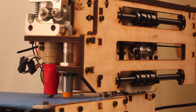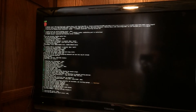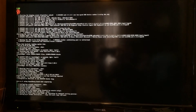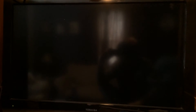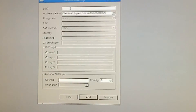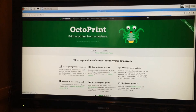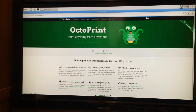One last upgrade I did was to install Octoprint on a Raspberry Pi. Octoprint is a software package that allows you to hook a little Raspberry Pi computer up to your 3D printer and use that as the method for controlling it. Instead of tying up my big expensive laptop, I can use a $40 Raspberry Pi, use a web interface through Octoprint, upload files to be printed there, and let the Raspberry Pi do the work. I've made some initial runs using it with the PrinterBot Simple Metal, and I'm really pleased at how well it's working so far.